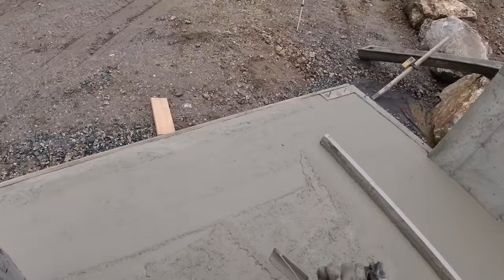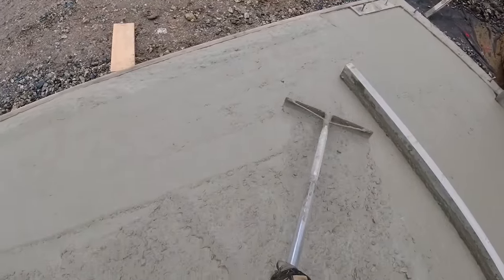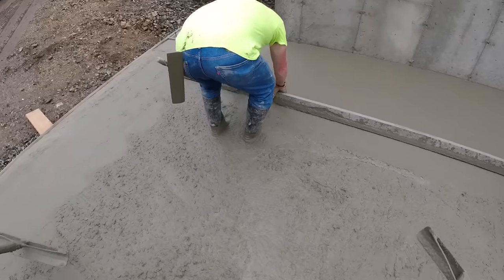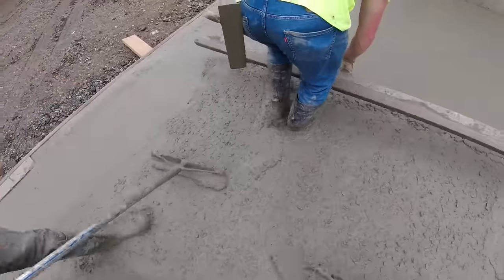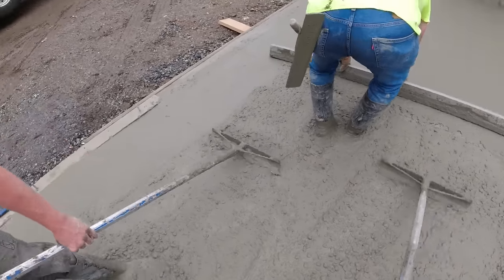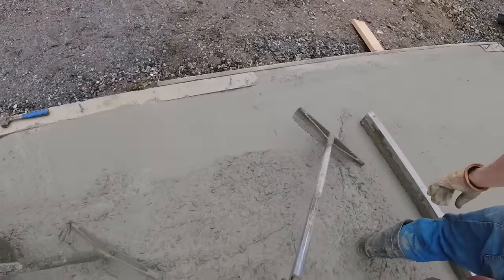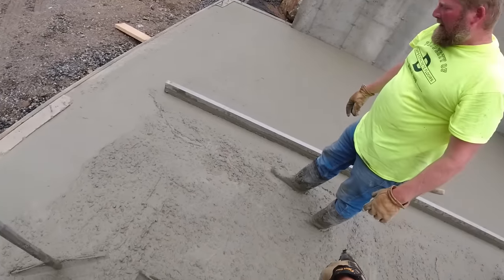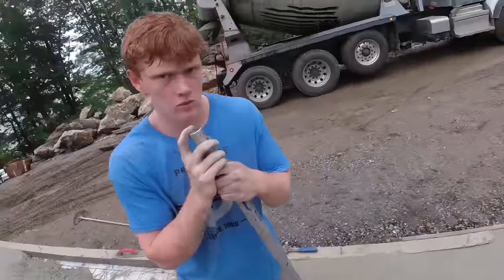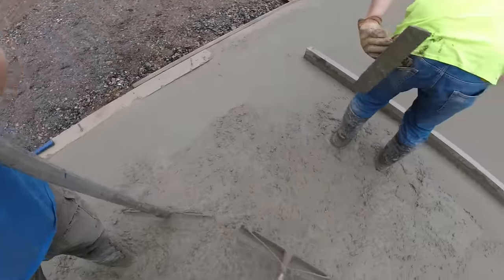Show him how to do that, okay? As he's straight edging, okay, you want to pull that, okay? But don't dig in, just make sure you don't hit his hand as he's doing that, okay? Yeah, keep that low. Keep that low. Just building up. This here is way too high, so that's okay. More important to keep that low than this is over here, okay? Right. So as he's straight edging, you do this. Right. And it's a lot easier on his back. You wouldn't know that, but I'm just telling you, okay? And then he doesn't have to stop and start either. So your job mainly is right here.